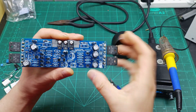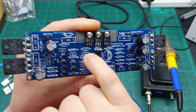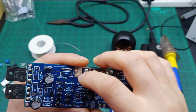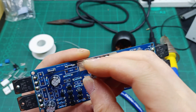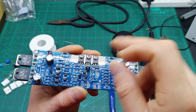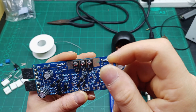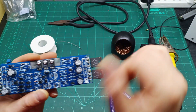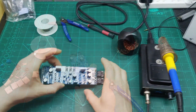Almost all the resistors are soldered in place except the 1k resistor in the middle, which is the bias resistor. Instead of using a fixed resistor, I'm going to use a trim pot so I can adjust the bias accordingly. Let me check the listing to see if it specifies the quiescent current. I'll solder the 1k here and here, and install the trim pot in the bias position.